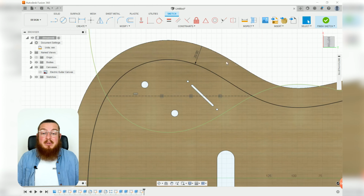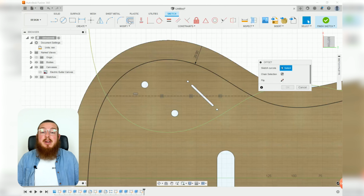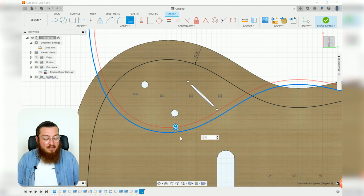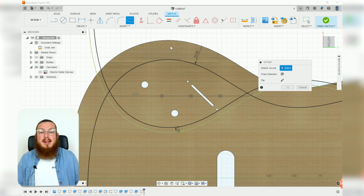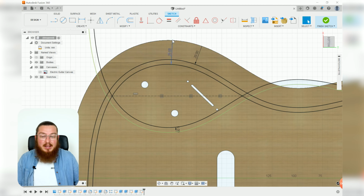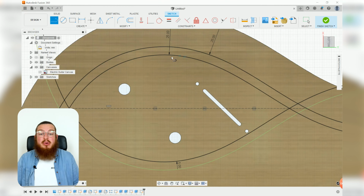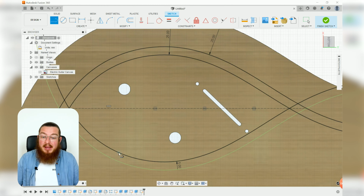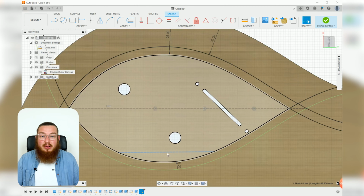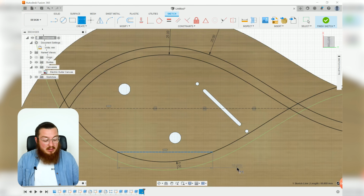Now we do want a little stepped feature inside this cavity so a plate can be rested onto it. So I'm going to be using another offset, something from the bottom that gives us about 5 millimeters. And annoyingly, you can't make an offset from an offset. So I'm just going to be adding 20 to 25, give us negative 25, and that's perfect. So for this project, we're going to be having 3 screws in all these corners that can hold down our backing plate comfortably. So I'm going to be making another totally horizontal construction line. So let's click X, that looks like it's at an angle, so let's change that to be totally horizontal. And this wants to be 80 millimeters long.